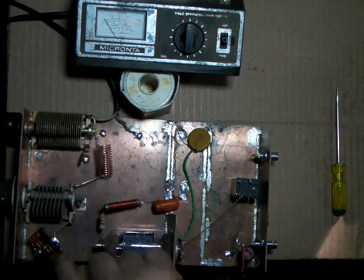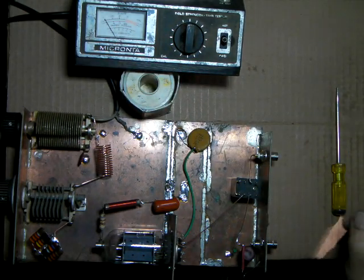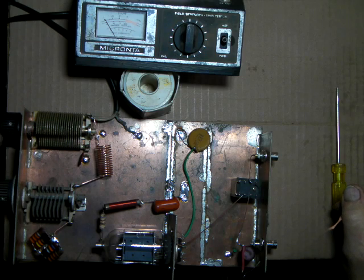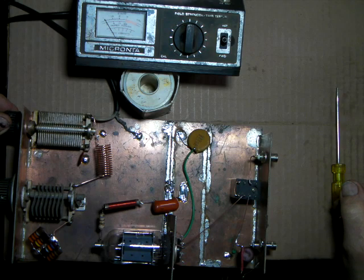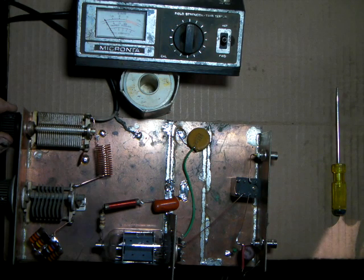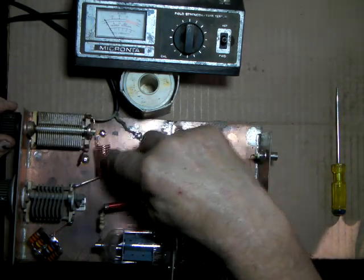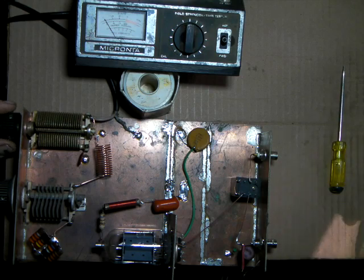Now, like if I couldn't get that low enough, no matter what I did with the caps, and as long as they have range, in other words, you wouldn't want your cap wide open or fully closed, that tells you that you're off too far one way or another. Or if it's all the way closed, it would tell you that you don't have enough capacitance. But this circuit is tuned pretty good. It's just a little past mid-range, which is good enough. That would get you by.